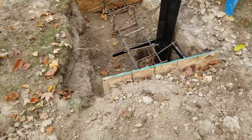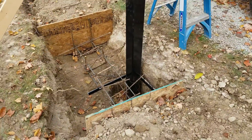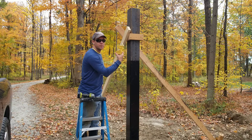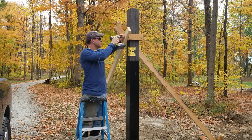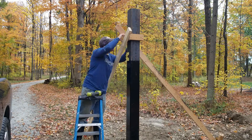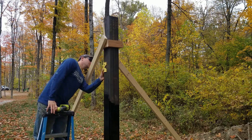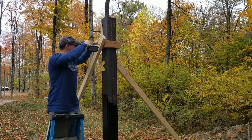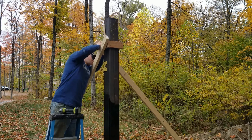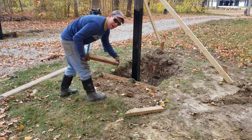On this side we did the same thing — tightened her up, three-bar cage in there. They came out of plumb a little bit during the week — had about three-quarters of an inch of rain, so they kind of settled a little bit. So I'm going to pull them up. Magnetic post level is where it's at, guys. That post over there is a little bit wobbly, so we're going to drive an insurance post here.